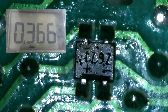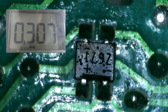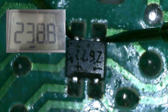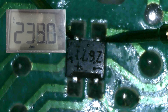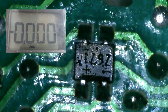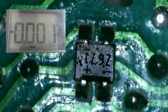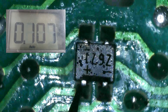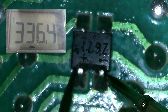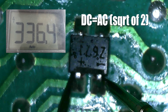There is already a supply voltage. As you can see on the input AC, we have 238 volts. Now let us measure the output DC with the meter on DC mode. What do you think we will get on the output DC? And we have 336 DC. So we got an input AC of 238 and an output DC of 336.